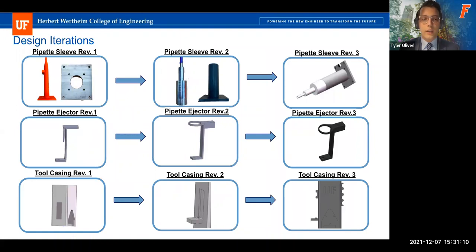Going through our design iterations — in the top left corner you can see the 3D-printed part that inspired the rest of our design. A couple of issues we ran into with this iteration were mainly DFM issues, specifically the total length of the cylindrical portion given the internal radius with the existing drill bit sizes in the lab. We were also hoping to weld the cylindrical face onto the machine square face, but we had concerns about the ability to weld that properly.